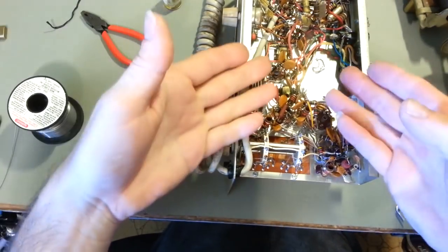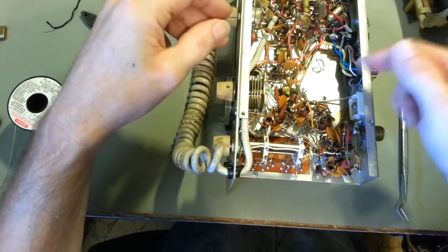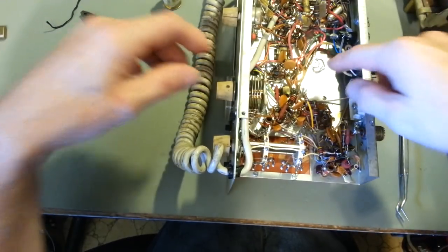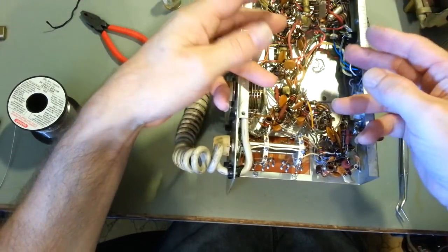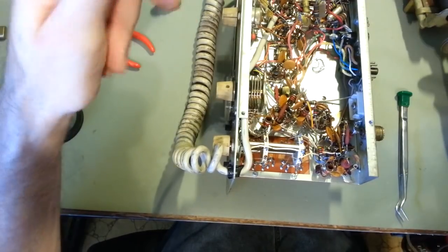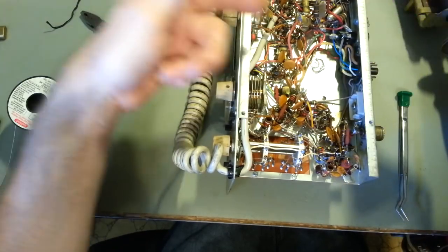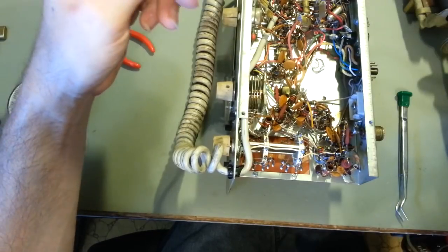Now, another thing is, when you're doing something like this, normally I would just desolder, because normally most can capacitors would mount to the top side of the chassis, and you would see the bottom side from down here. This one, laying down on its side, I would normally just desolder all of the wires soldered to those components. That was almost impossible in this because it was tucked down in there. There's just no way to get down in with a desoldering iron. Maybe the one top terminal, but the other three, there was really no way to get to.